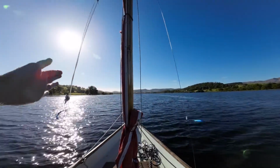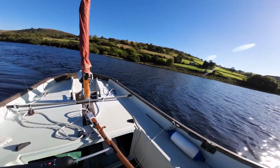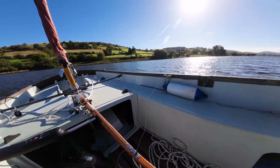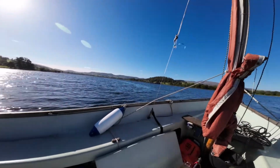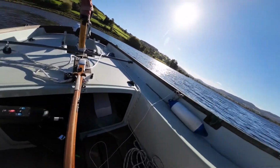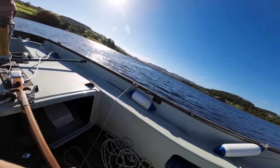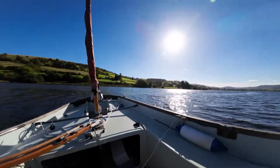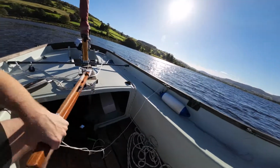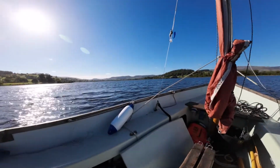And now look, the wind will be acting on the port side now, so you'd expect this to suddenly start to, there we go. In fact, we probably overcompensated there. Okay, and now it's just come off. Let's put it into standby. What happened there was the rudder got stuck on the mainsail block, so let's come about and we'll try that again.